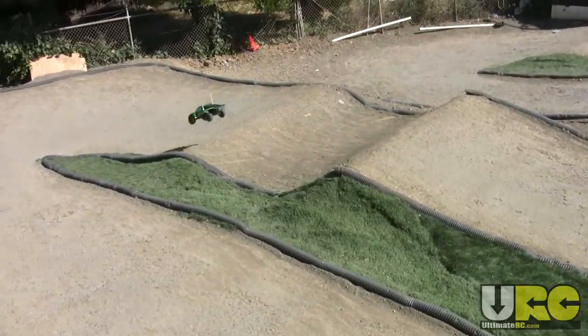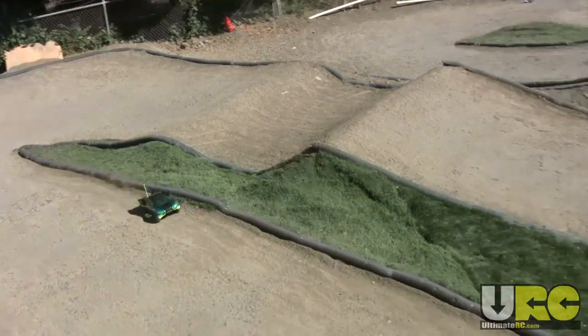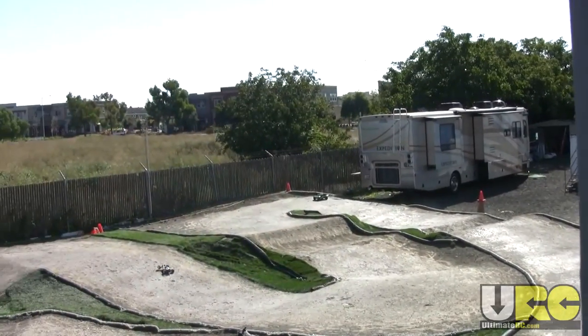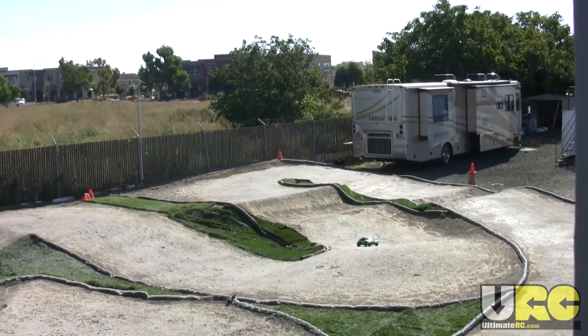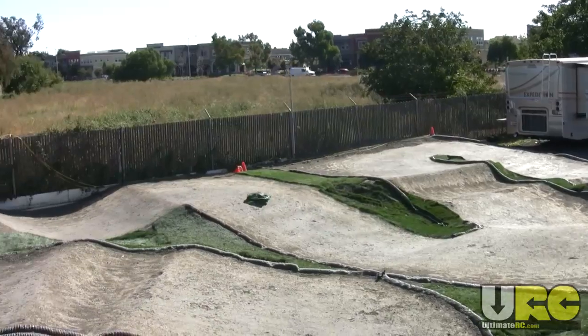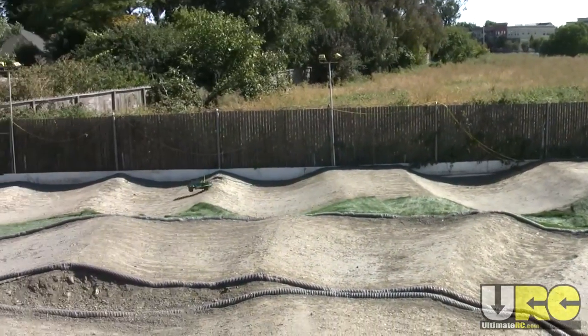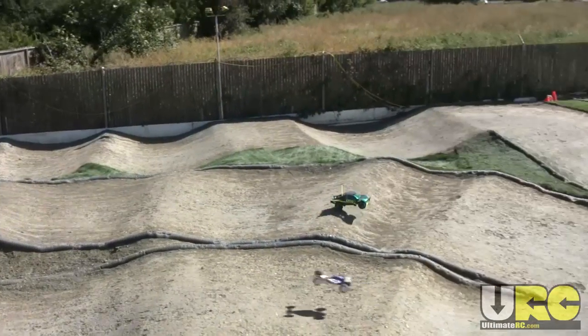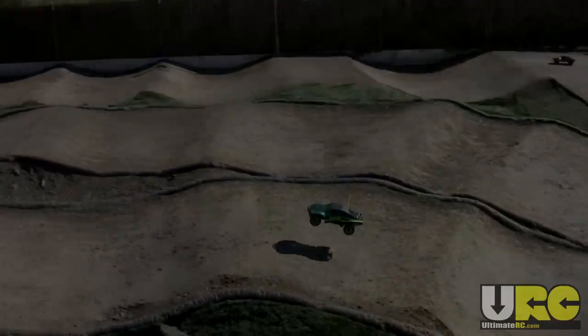So the amount of power that I was able to get out of this small little motor was just absolutely phenomenal. And again, I was running it right around the temperature where I normally like to run a brushless motor, around 160 degrees Fahrenheit, measured on the outside at the hottest point, which is normally well within the comfortable range. It's a little bit aggressive, but not too bad. Then disaster struck.